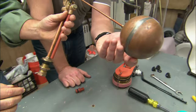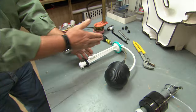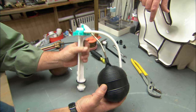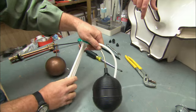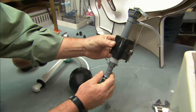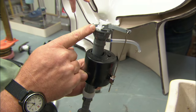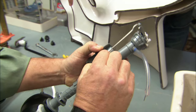I have never seen one with a copper float before — this is old. Over time it transitioned to plastic. Here's the plastic water regulator with the float right here. These floats were always tricky; you had to get them adjusted right, and to do that you often had to bend the brass rod to get the level correct. Nowadays, this is what you see in almost every toilet, where the float is an integral part of the ballcock. The water rises, the float shuts that valve off, and to adjust it you just open and close the spring clip to slide it up and down.